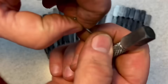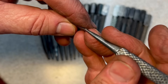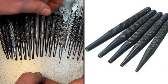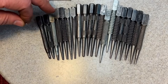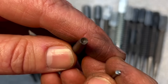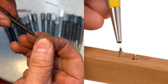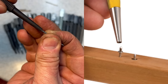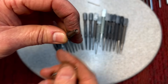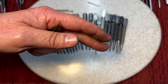If you have a real small brad or nail, it's so small it's very hard to fit the nail set on there — it's almost as big as the nail itself. So you can take a hollow punch. What happens with a hollow nail set is it fits over the top of the nail. You can see the tip of this punch is hollowed out — it'll fit right over the top of your nail, and when you're driving it in, you can drive it in without it slipping off and marring or damaging the surrounding woodwork. You'll see these for smaller work — brad work, finished carpentry, things like that.